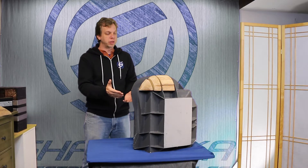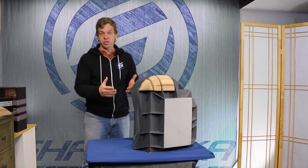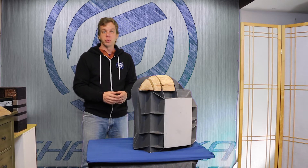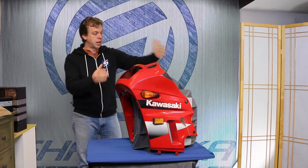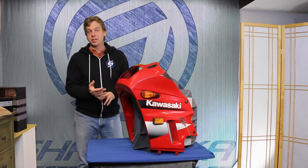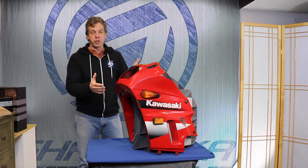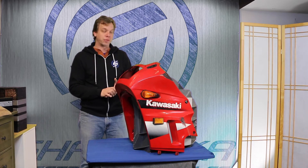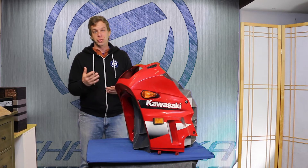We've got our blocks as one method for finishing off the adapter unit and getting a smooth outer surface for aerodynamics and general looks. Another way to finish your motorcycle is with the fairing — when you use the original fairing from the motorcycle, you're able to hide the entire adapter unit underneath that original skin. On the Kawasaki Ninja series, the Honda CBRs, and a number of other manufacturer sport bikes, the original fairing can actually fit over the slim version of our adapter. For the big, heavy-duty battery packs, we can trim away some inner fairings or create all new custom bodywork.